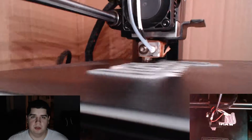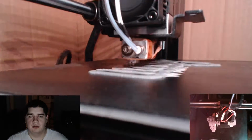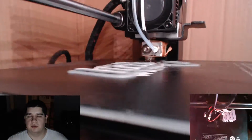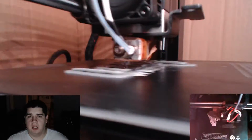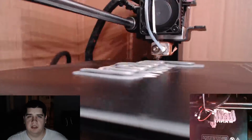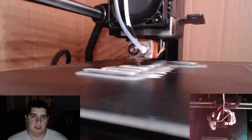So I sliced the model with a 1.2mm shell and 1mm top and bottom layers, as well as a 30% infill. I used the version of Cura that Wanhao includes on the SD card with the printer to do all this. Thanks to the durability of the ABS filament that I used, the name plaques themselves, where the names kind of hover in midair, can actually sustain quite a bit of flex without any damage done to them.